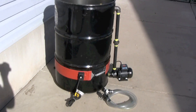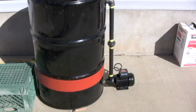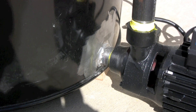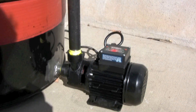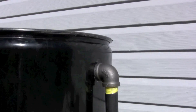So let's show you how it works. The system is fairly straightforward. We took a standard 55-gallon open top drum, knocked a hole down in the bottom, welded in a one-inch closed fitting, then we attached one of our one-inch processor pumps, installed some plumbing with a union, put an elbow on it, and then this elbow just goes right into the tank.